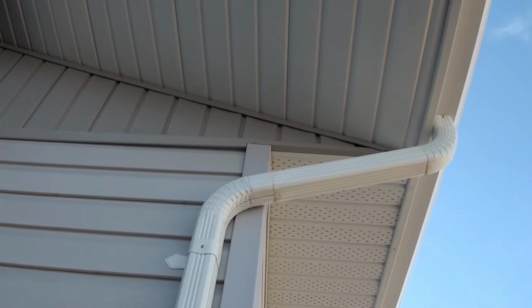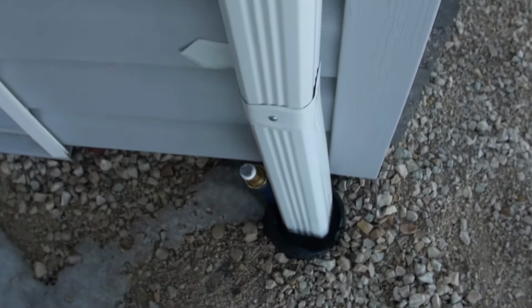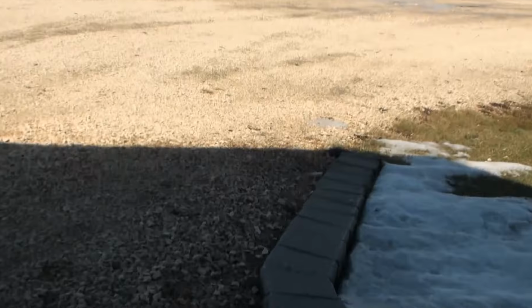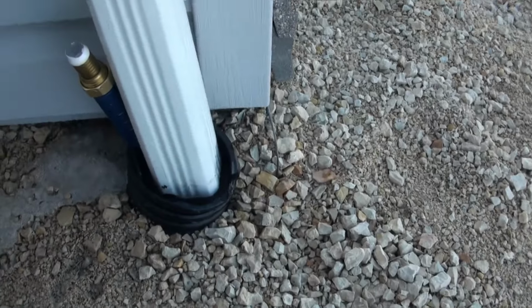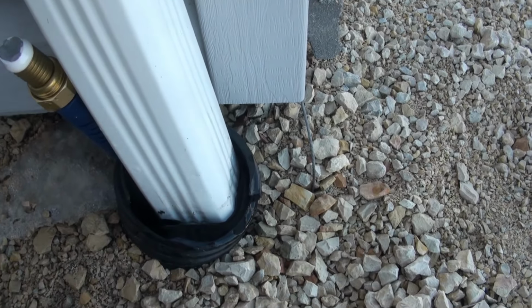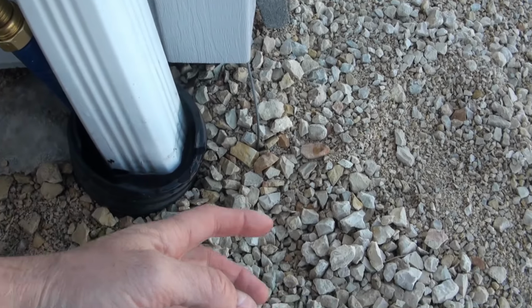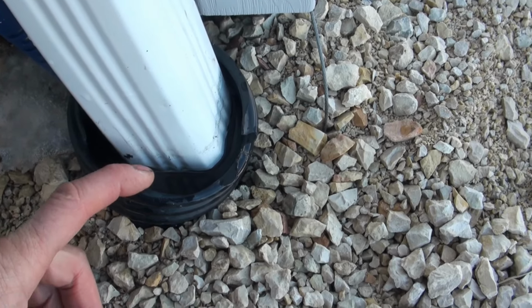So a problem that I've been having is the drain for this downspout will freeze up in spring. The downspout enters into this pipe here, and that pipe goes underground and exits over there somewhere. I will show it later. So I think the way this works is the snow, as it melts and enters into this pipe, because the ground is frozen and this pipe is cold, the water turns to ice, and then after some time it becomes frozen and it can't drain.